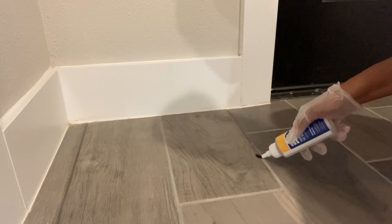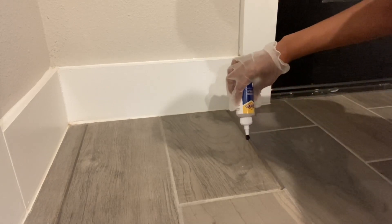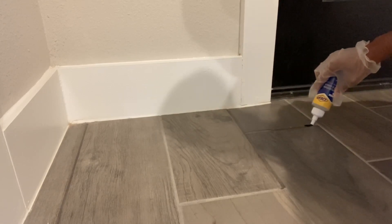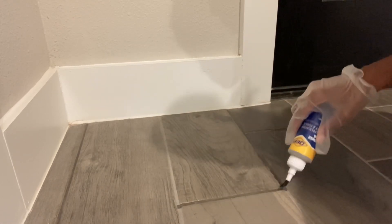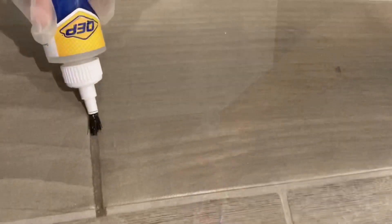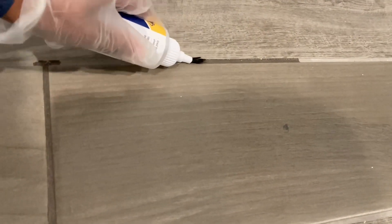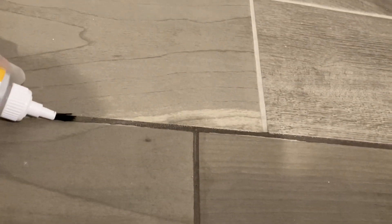It is exactly like coloring or painting — you literally just put the tip of the brush into the grout line. As you can see, it turns wet when you apply the sealant. It goes from white to a dark grayish, wet-looking grout line. Here's a closer look so you can see exactly what I'm doing. This is all I'm going to be doing for the next three hours — it took me a little bit over three hours to do all of the areas.